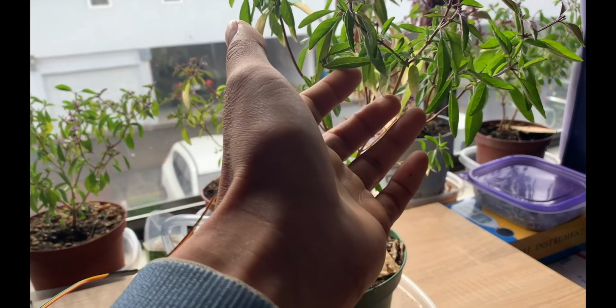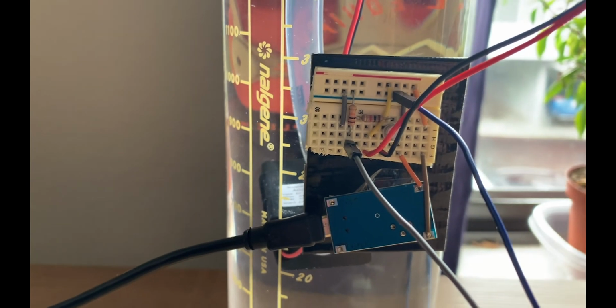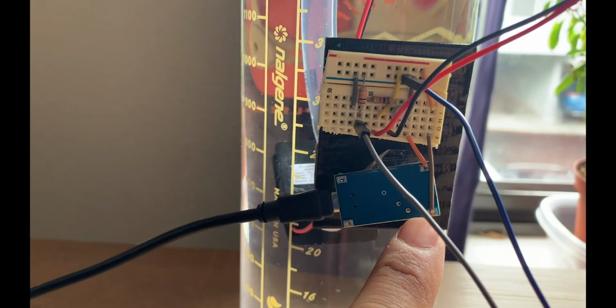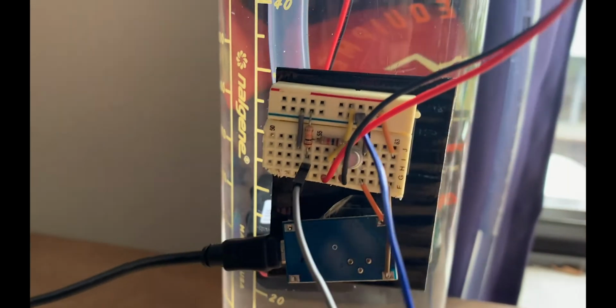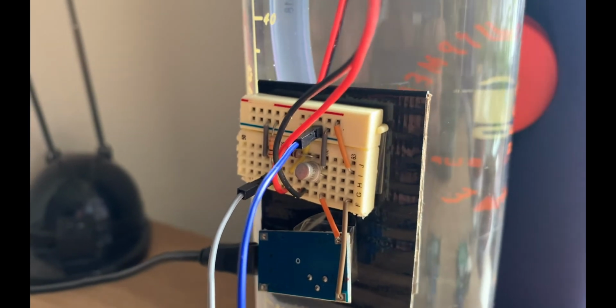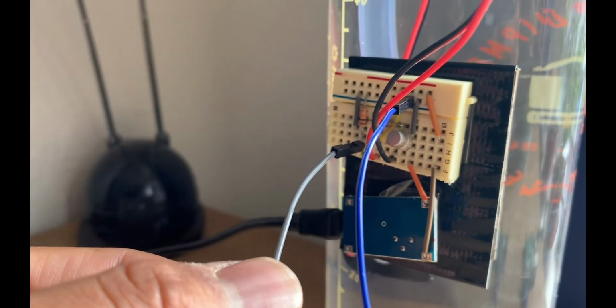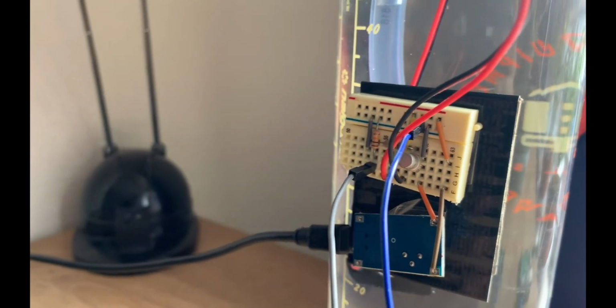All right, here is the Raspberry Pi Arduino setup for the automatic plant watering system for my beautiful basil. This is a power voltage adapter which converts 5 volts to 12 volts through a special circuit, and this is my custom-made, beautiful transistor circuit, in which this gray wire is basically a switch that turns the transistor on or off.